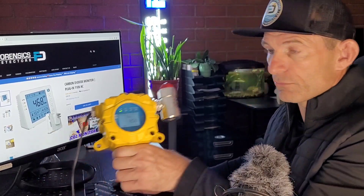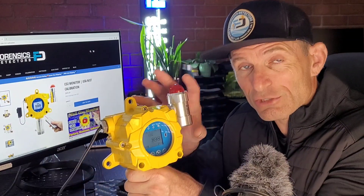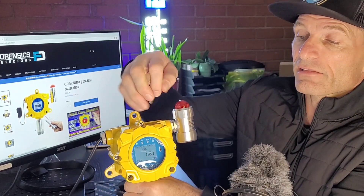Now, the unit we're talking about right over here has industrial specifications, that's why it's substantially more expensive. It comes with various things. The unit is calibrated to NIST-traceable sources, so it's very accurate. You do indeed get your calibration certificate. You get your color manual, your power supply to provide 24 volts to the unit, and your remote control to control the unit from a distance, and your allen key — your little hex wrench. If needed, you could take off the front cover. There are five hex screws; you just take them off. The front cover comes off, and then your electrician or handyman can wire up your appliances to the relays.